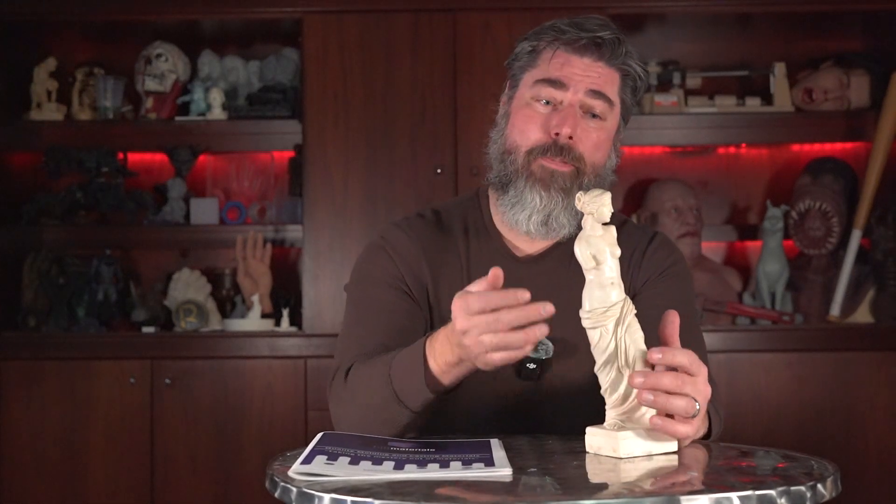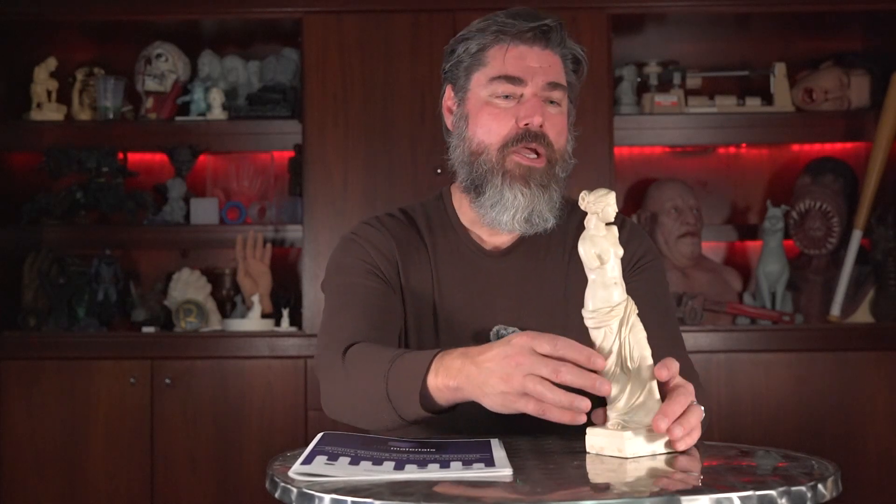For those of you doing really detailed 3D prints that have a lot of fine detail, you probably want to pressure cast your parts. With a brush-on mold, no matter how well it's made, it will have tiny micro bubbles in between the layers of silicone. Those don't typically amount to anything unless you pressurize the mold. Being able to vacuum degas and pour the silicone around the part eliminates that and allows us to have a mold that can be subjected to pressure later on.